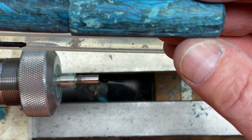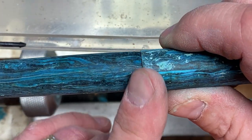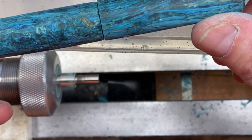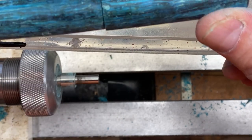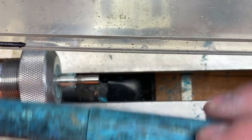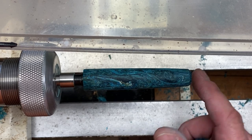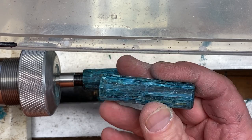Not too bad. There's a bit of a gap there that we need to take care of. I'm thinking we put this back on the lathe and maybe chamfer it at a 45 — that'll complement this end of the cap and this end of the body, and it may fit just fine. I'm going to square that off a little bit. Since the plan is to chamfer the outer edge of the cap blank, we're done with the body blank, so I'm going to go ahead and get it cleaned up with some denatured alcohol, get a CA finish on it, and then we'll make whatever modifications we need to make to the cap.